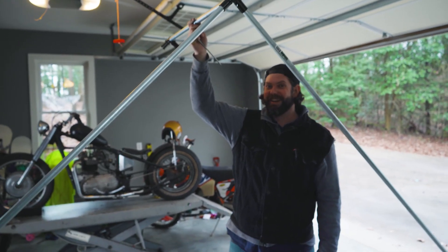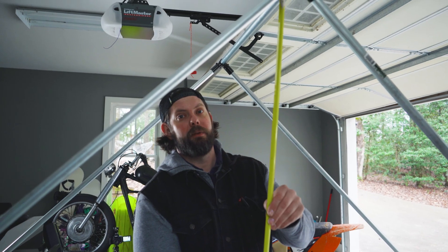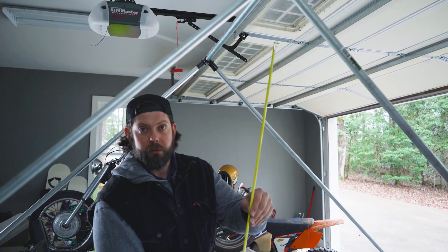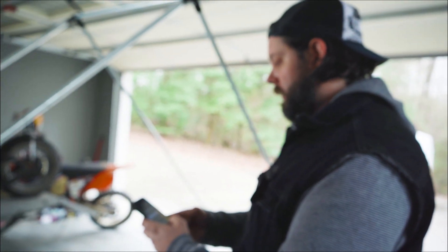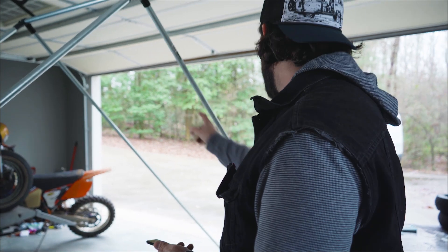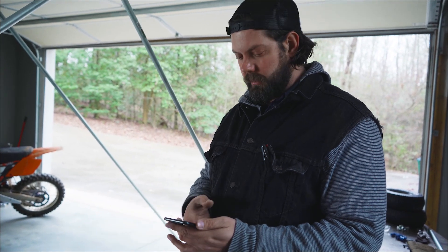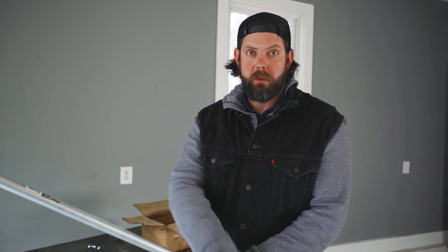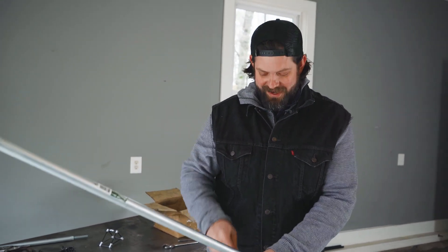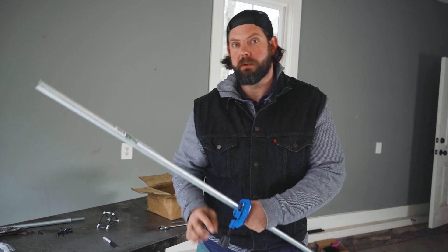That's pretty high. If the conduit is split in half and the pivot's right at five feet, we need enough vertical clearance so the weights will clear underneath. Divide that by 12 — 7.75 feet — so the hypotenuse could be seven and three-quarter feet, giving us five and a half feet of vertical clearance. We're building the main structure basically five and a half feet tall, which is pretty big. That should accommodate the 10-foot slinging arm — technical term: slinging arm. We're going to build that structure, test it out, and see what we're up to.